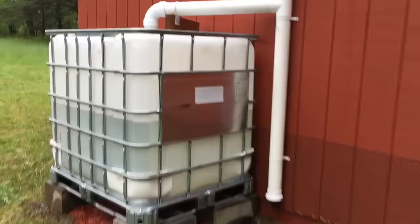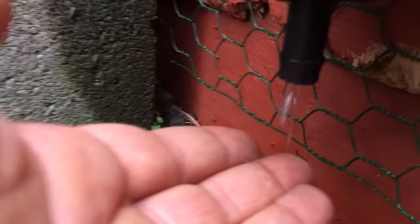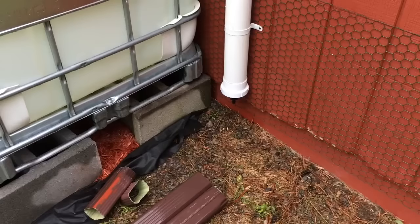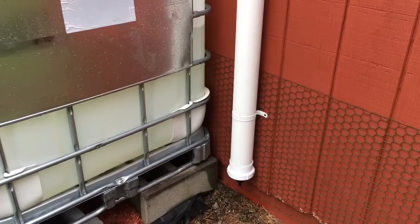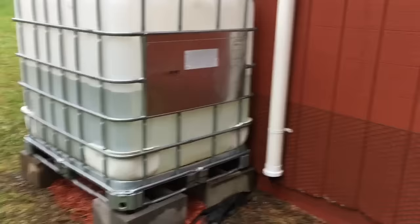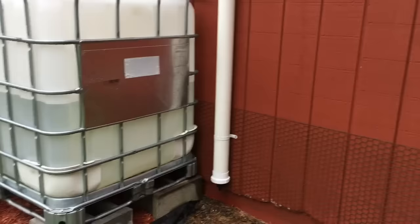This is my father-in-law's system — it's only about half full after an inch of rain overnight. One of the issues is the first flush system: water is shooting out of it too fast. I put the largest hole possible in there so it wouldn't clog, but that's letting out too much water. I think I want to go to the smallest hole, because even a small leak over a multi-hour rain equals many gallons lost. I'll swap it once the tube drains after this rain event.